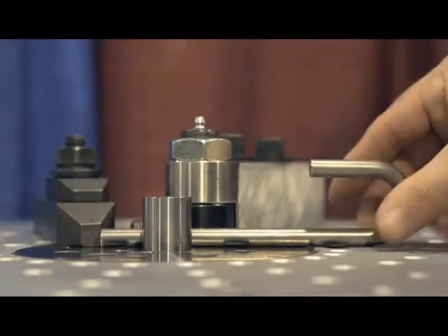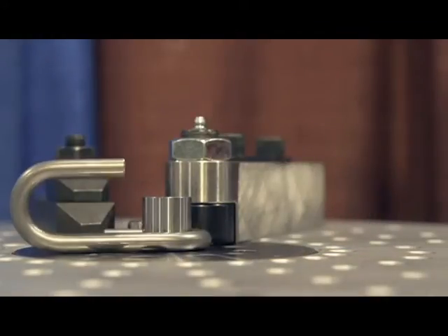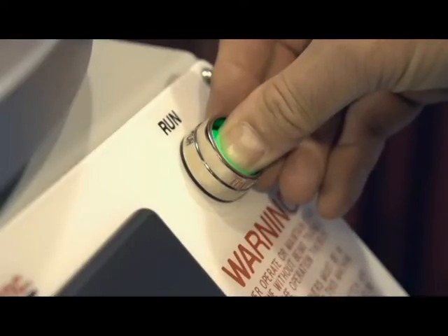The standard 24-inch round tabletop is precision ground to one-inch thickness and features half-13 threaded fixture holes and is hard chrome-plated for wear resistance and durability.